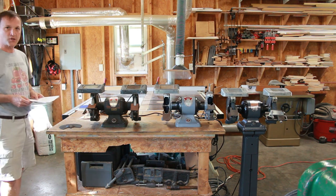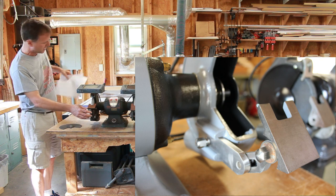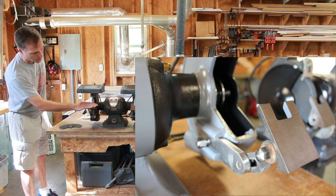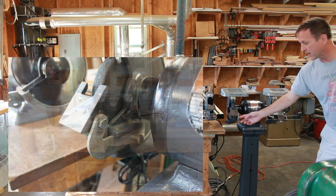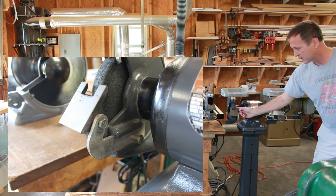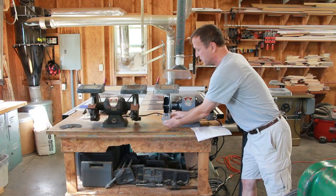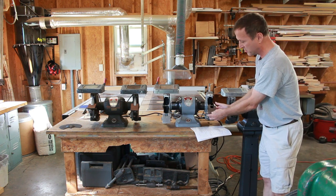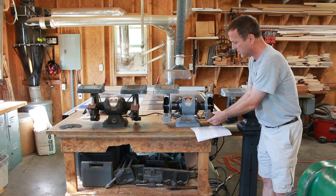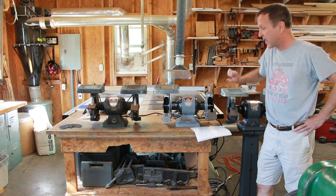Looking at the basic tool rest mechanism, it was a three-piece part. The top piece is the tool rest itself, then you have an extension piece, then the arm piece. By the 1950s, the extension piece and arm piece had been simplified into a single piece. The three-piece design is far easier to adjust — just a couple of turns and you can move them every which way, which is great for flexibility, though sometimes a little hard to lock down. Consequently, the washers are often in very bad condition from being tightened so much.